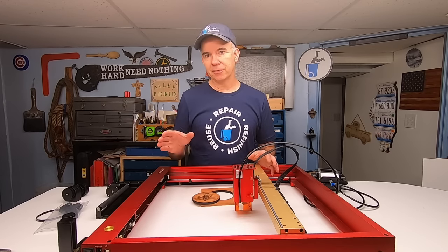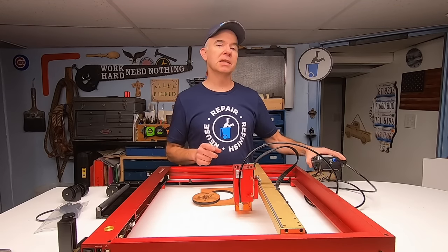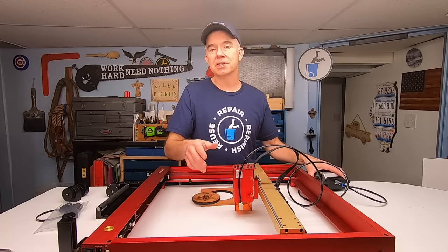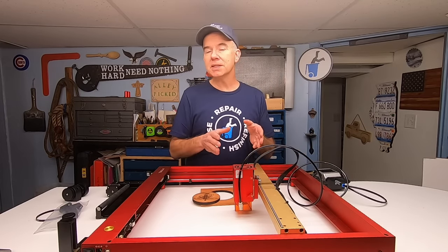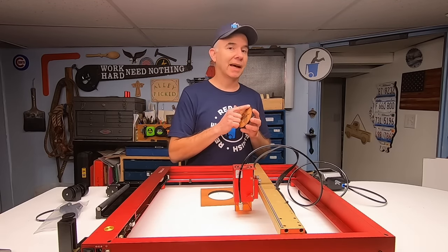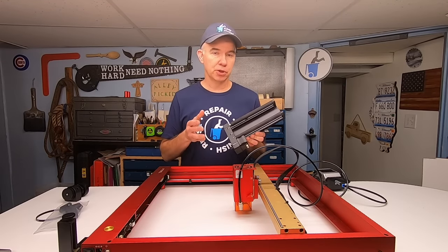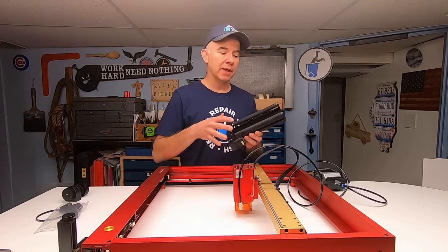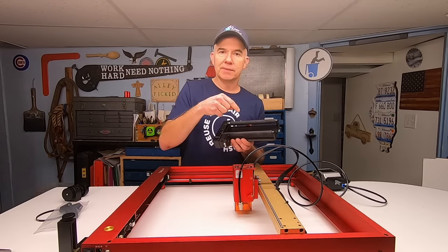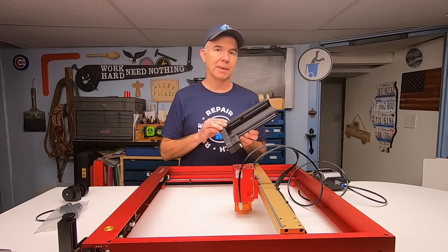There are a lot of accessories you can buy for your Xtool. I only have two that I'm going to briefly go over today. Number one is this air assist tool — basically a compressor that pumps air onto the surface as the laser cuts. The reason this helps is if you don't have it, you're going to get burn marks on some of your surfaces; with this, you get nice clean cuts. The second accessory is the RA2, a rotating accessory tool. It plugs into the unit and rotates your object automatically as the laser engraves and cuts — it's the only way you can really engrave on round objects. I'm going to show you this in real time.